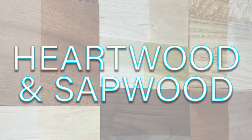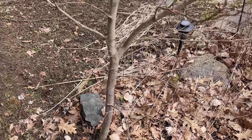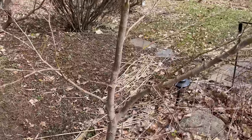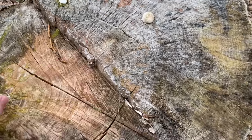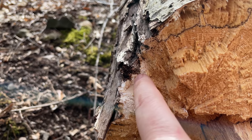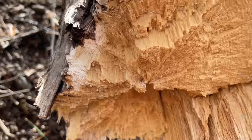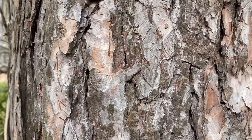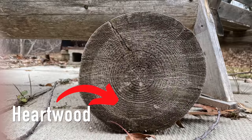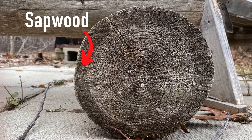For those who like to paint wood it won't matter as much, but for anyone doing more restorative work or paint-and-wood combinations, this is going to be important. Let's talk about the composition of wood. Timber that has been readied for use in furniture is composed of either heartwood or sapwood or a combination of both. When a tree is growing it forms a new outermost layer — usually annually — and over time this forms the growth rings we see on a cross section of a log. The outermost part is called the sapwood and is essentially the living part of the tree.